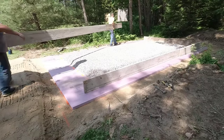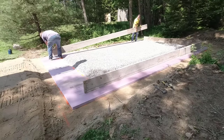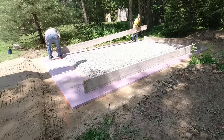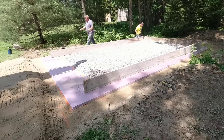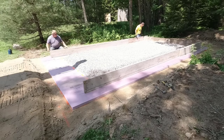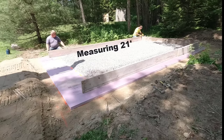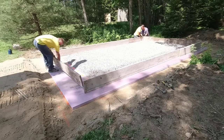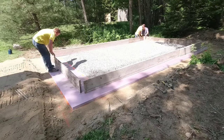The styrofoam is 16 by 24, the slab is 12 by 21, and on top of the styrofoam he put six inches of crushed rock. So we've got 12-inch thick edges and a six-inch thick slab — he built up the middle with crushed rock after putting the styrofoam down. We need styrofoam here in Maine; it's code, and it helps keep frost from getting under the slab and heaving it.